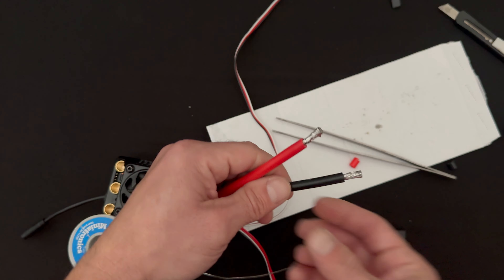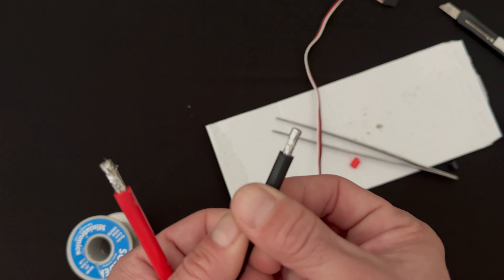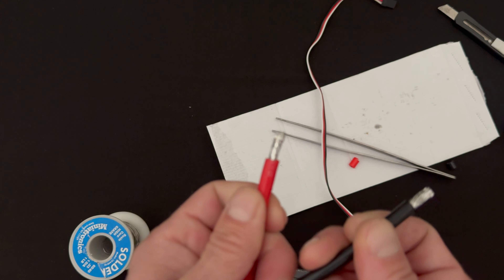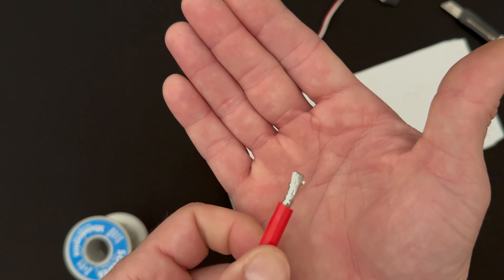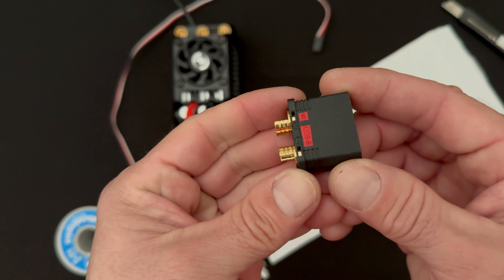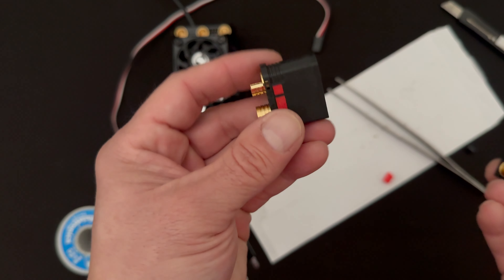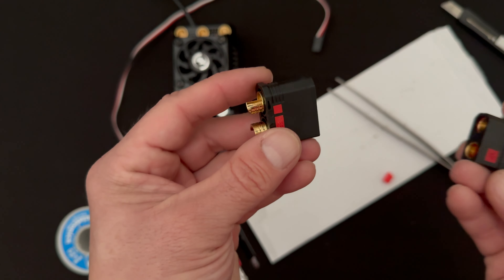Let's check these tinned wires - you can still see the strands, the solder is not blobbed on super heavy. These plugs are marked for polarity. We'll do the negative wire first. Another thing I like to do when working with plugs is to plug in an empty one on the other side to act as a heat sink so the plug doesn't soak all the heat. On XT style plugs, the skinny side is the negative, and they're also marked down here for extra safety.